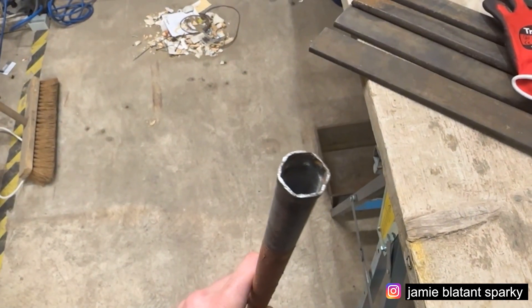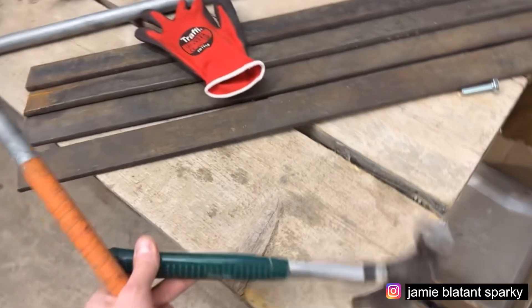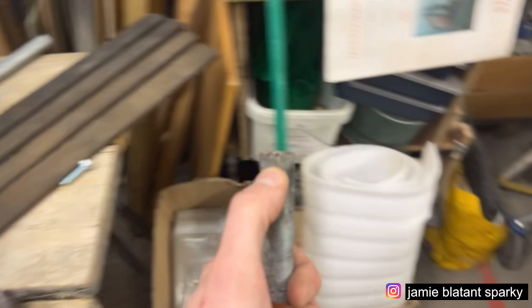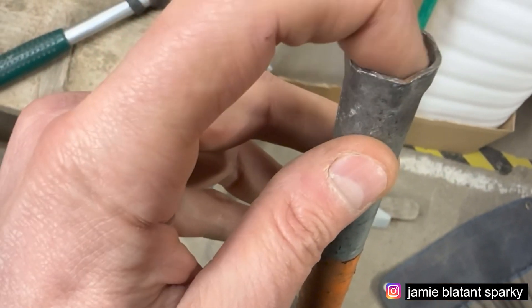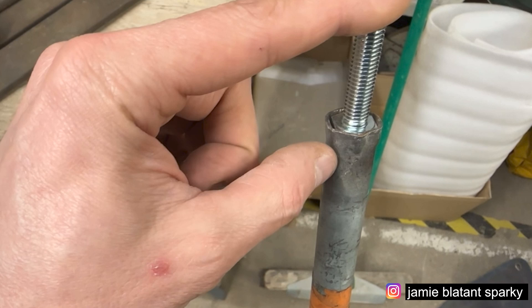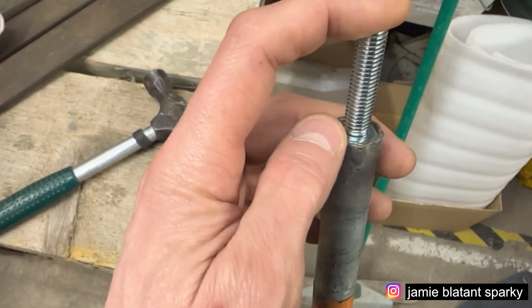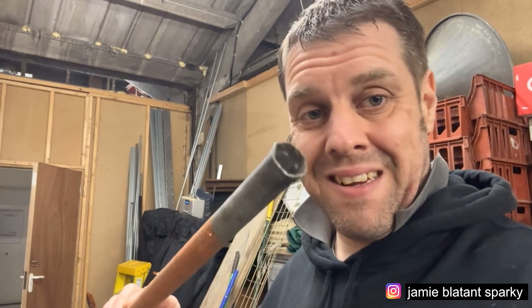It's not for a high-torque application but it works. When it's worn out you'll still have a little bit of hexagon left — just get a normal nut, bang it in half a thread, then sliver the end off again with a bandsaw or a saw, reheat it and harden it again. So that's how you make your own box spanner in 10mm to any length.